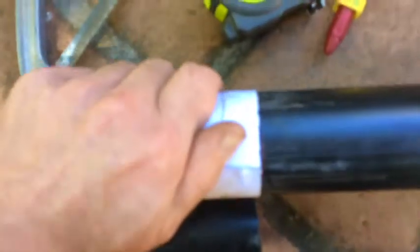All right, we got the angles right. With our piece here, we go about right in the center and take this little measurement — we're going to come out in the center of that rim joist there. Here's the trick to getting a clean cut every time: this piece of paper. See that mark? It's one inch longer than that. We just wrap this around, take our crayon, mark the perimeter, and then you get a nice square cut.